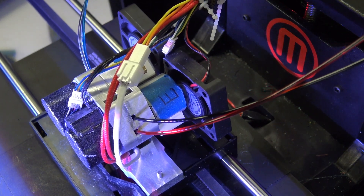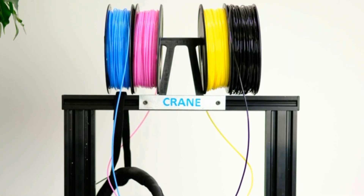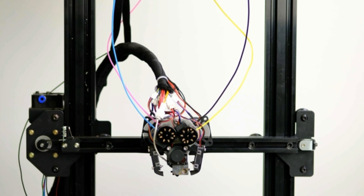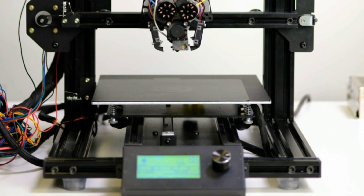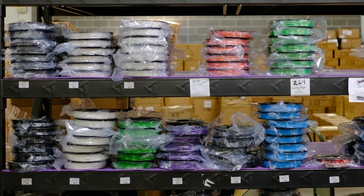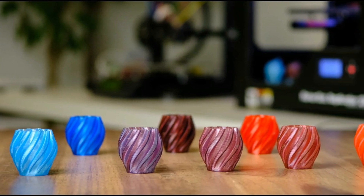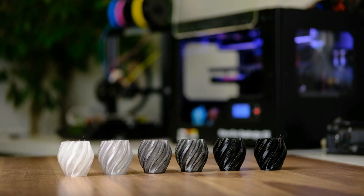We also want to nurture the ecosystem for people who have already spent money on a high-end 3D printer. So we're making a few mounting plates that allow people to adapt a Quad Fusion printhead to a typical printer — we've already built mounts for the MakerBot Replicator 2 series, the Pro Mega, and of course the Crane. In the past, if you wanted to print a lot of different colors, you'd have to stock all of those colors and buy a huge quantity of filament. Now with just four, five, or maybe six major colors and keys, you can produce any color on the fly — whether you want one new color or multiple colors within the same print. The same applies to multiple materials: taking a flexible and a hard material and merging their properties to create a print with mixed properties throughout is definitely going to advance the field and help us realize the potential of 3D printers.